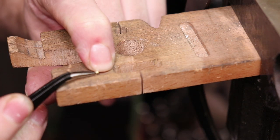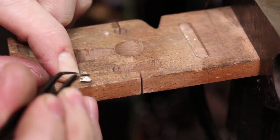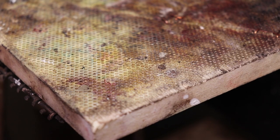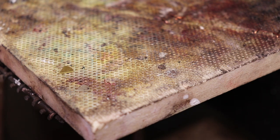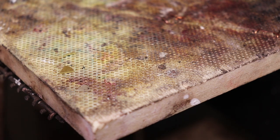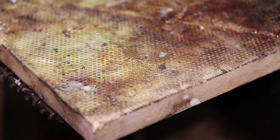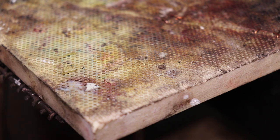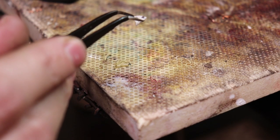Now I need to take the paper off all of these before I do anything else. I'm going to put a couple of my pieces on the honeycomb board so I can start soldering them together. I need to flux them, but not too much — it will just bubble up and everything will move around. When you're soldering stuff this small, little movements mean a lot. It doesn't look like it's coming up well on camera, so let me put this onto a charcoal block.